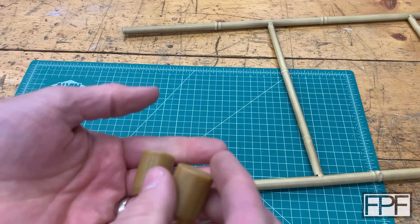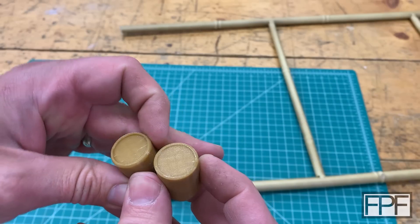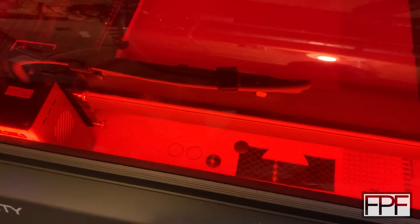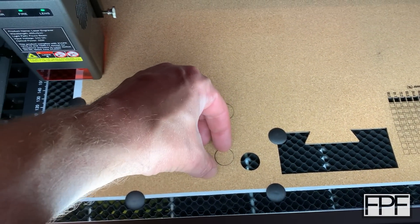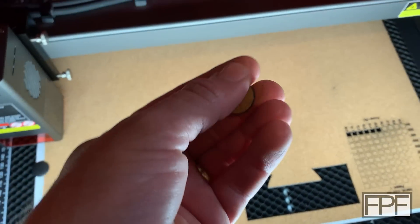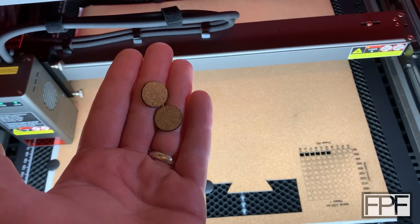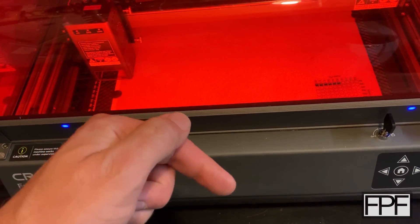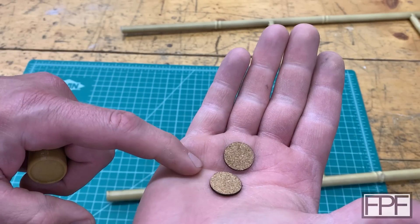It's time to cut the cork — that's pretty small and I could cut it by hand but it's not going to come out very clean. I checked and I don't have any punches that size, but then I remembered I have a laser. This laser has been absolutely awesome for projects like this. I'm able to take the same drawing we did for the 3D print, export that bottom face as a DXF, and in seconds I've got two of these. This is the Creality Falcon 2 Pro — I did a whole review video on it and I'll link that in the description below.